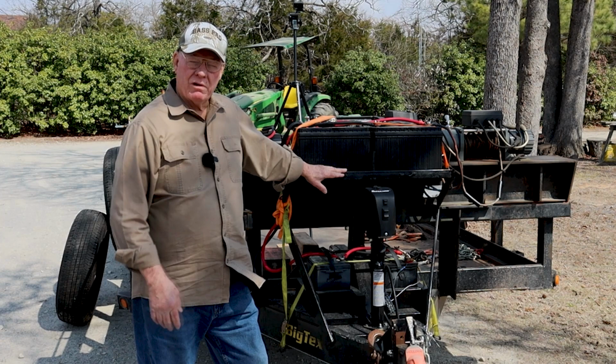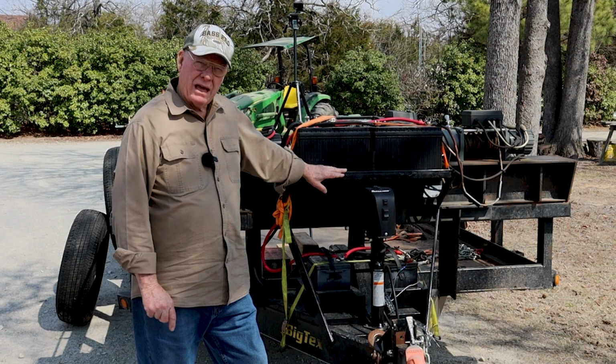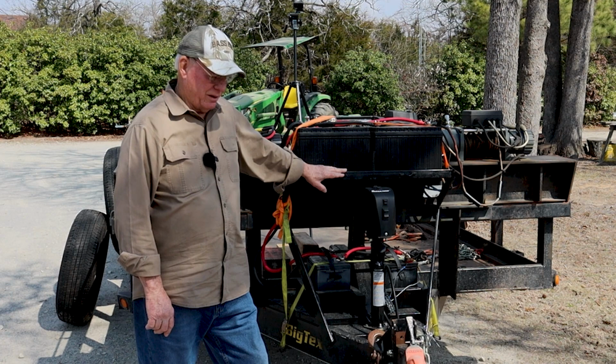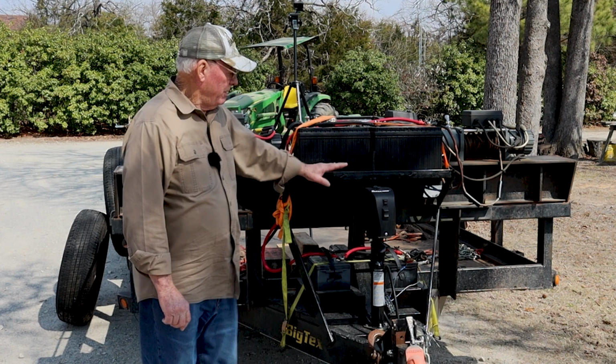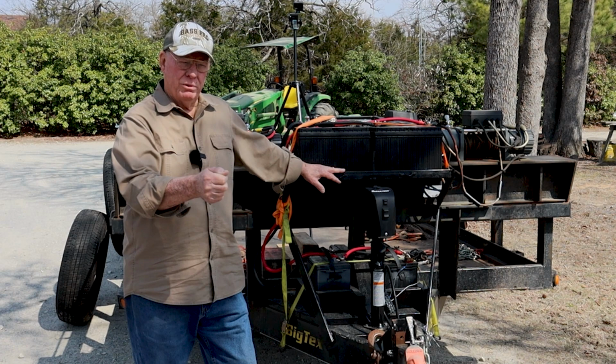with this configuration. So if you're gonna get a trailer and if you're gonna use winches on it, depending on the size of log you're loading, if you're just loading little logs, it's not that big a deal to set up a trailer. But when you start loading massive big logs, you need a lot of battery to drive these winches. And the other thing you gotta constantly keep in mind is these winches get hot when they're just sitting there just pulling, you know, 8,000 or 9,000 pound log, they overheat.